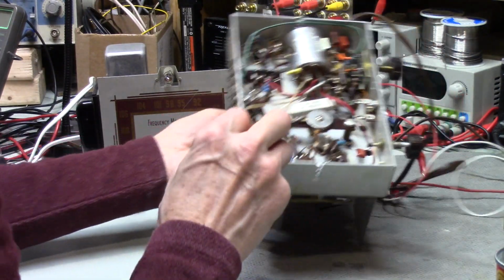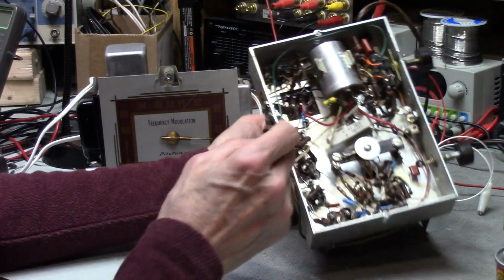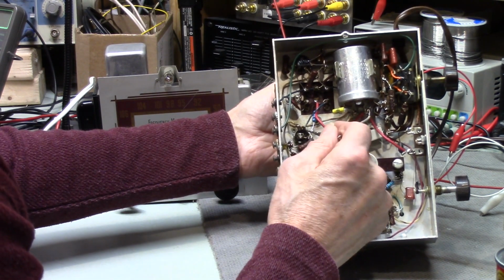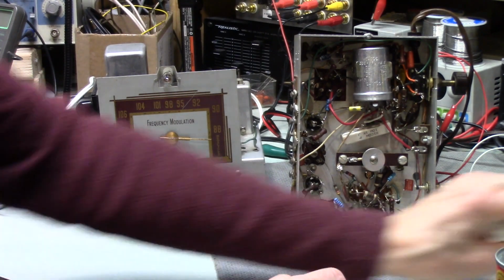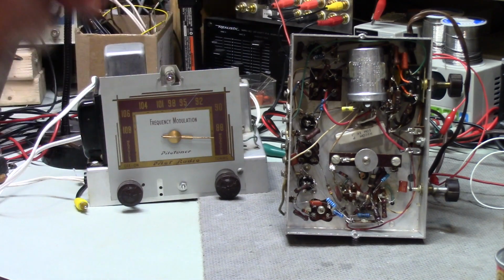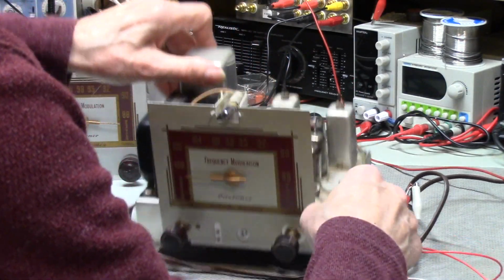that you'll notice on all of these sockets is they have a center ground pin. There's a pin in the middle, and it's grounded to the chassis. And I'm pretty sure you want that in there. So even though I had 7-pin sockets, they weren't grounded like that. So I would have had to get that to resolve the problem with that socket if I hadn't been able to get it to work. But thankfully I finally did.